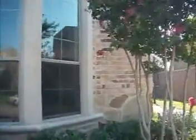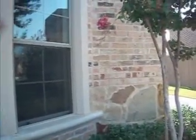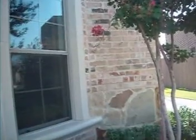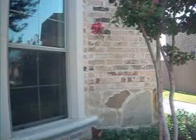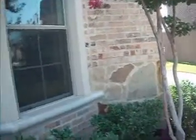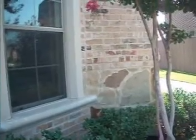There's a little bit of a settlement crack here, again due to common settlement. These cracks should be sealed. You can get a silicone mortar, which looks like mortar, or a silicone fill, to seal it and stop water getting in. If water gets in there in the winter and freezes, it's going to make the gap bigger and make the problem worse.